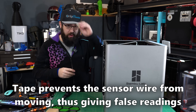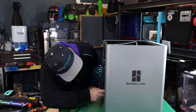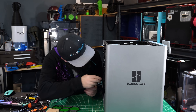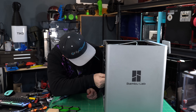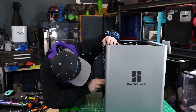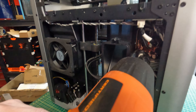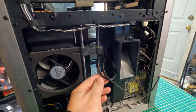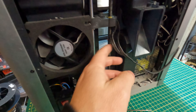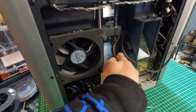I did try previously fixing this error with some tape, which is more of a temporary fix. As we see here, it's not working anymore. So take the tape out and now we can remove the bed wire. They did glue it on with that white adhesive they use, so it's going to be a little bit of a pain. I really hate that they glue these in — these are locking connectors, you don't need to glue a locking connector. The manual actually calls for using a heat gun or air dryer to heat up the glue. And the bed wires — they're just there, rubbing on the lead screw. There's grease and oil on it. There's really not a lot of room and it's constantly rubbing as it's moving.